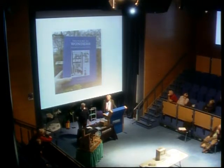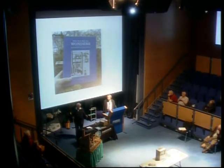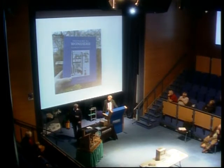Because when the need for heating the clay up to 1,100 degrees, burning coal, the combustion of the coal would have consumed the oxygen around the firing zone, and that would have fused into each brick the carbonaceous matter and made them almost zero water absorption. You know the blue bricks up to damp-proof course on older houses? That would be the same clay as the ones above. They would have been fired in an atmosphere depleted of oxygen to make them zero water absorbent. So instead of putting a damp proof course in.